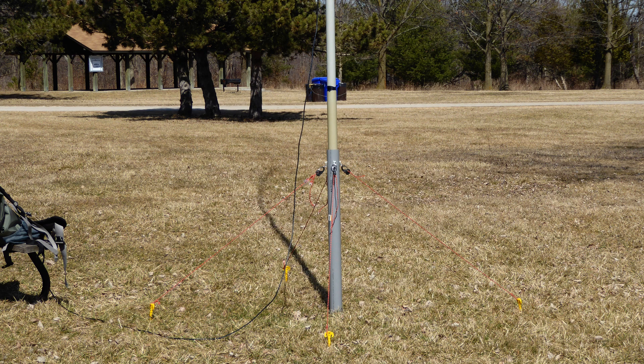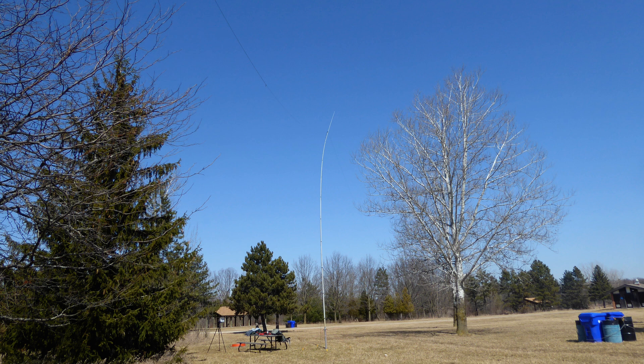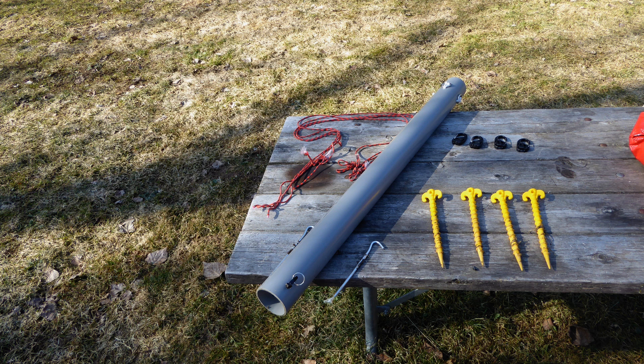So after all that, does it work? I recently made a trip to a local park and used version 2 in combination with my 50-foot DX Wire telescopic fiberglass mast. With the feed point of an 80-meter off-center fed dipole attached to the pole at the 40-foot point, and on a breezy day, the mast stayed perfectly upright for the duration of my activity. Will it perform in sustained rainy and windy conditions? Time and experience will tell. If it doesn't, then I will have a reason to start work on version 3. Do you have any further suggestions for refinement of the pole mount? If you do, please leave a comment below. That's all for this time — thank you for watching. Now it's your turn: get out of the shack, get outdoors, and get on the air. 73 from Tracy, VE3TWM.